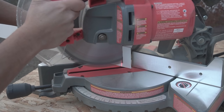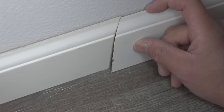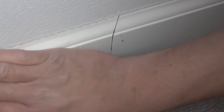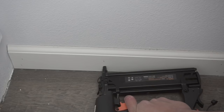This should sit flush with the other 45 degree cut, just like what you see there — it should flush nice and perfect. That is beautiful right there, nice and flush. What I do is nail down the first side first and then move along the second side. It might shift a little bit but after you nail it, it should sit flush and professional.